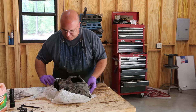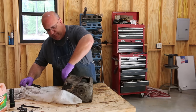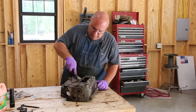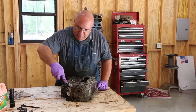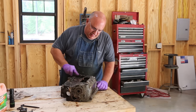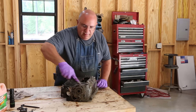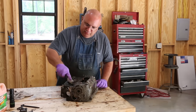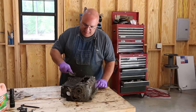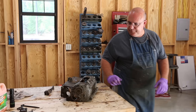After about three and a half to four hours, I'm pulling it out to see if we can get this cleaned off. Using a little plastic scraper, most of the paint is coming right off. What the scraper doesn't get, I can come in with a little paint stripping tool that has a brush on it to get down into those areas. It's coming right off — we'll work at this for a few minutes and get it cleaned up.